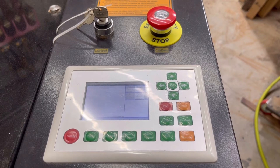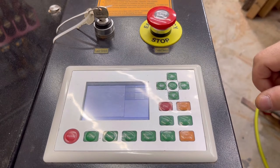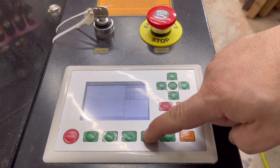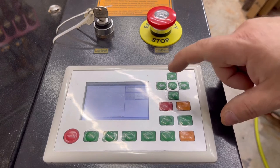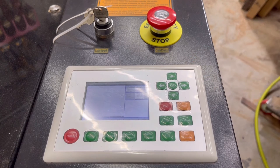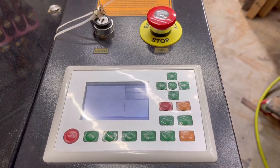Okay, we're back in front of the controller. Before we even fire a pulse or even turn the key to engage the laser, we want to set our max power to 15. It's very simple — hit max power, dial it down to 15, hit the center button, it will come down again, do the same thing: 15 and hit enter. That way it's only sending a pulse at 15 percent of the laser power. Once you've done that, engage the key and hit pulse.